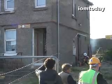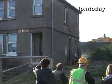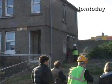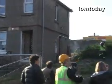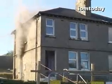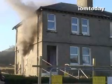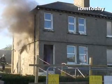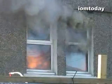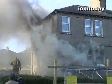If you now look, the only evidence of fire so far is smoke issuing from the side door of number five and the side door of number seven. At this time, no smoke detectors in the property have activated. The sprinkler system is not a replacement for smoke detection — it's an accompaniment. Both houses have now had the burners out and both gas burners have been removed. The fire on the right is now well developed. We are still struggling to get the fire from the sprinkler house to operate, but they are trying.